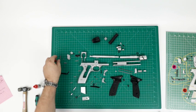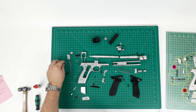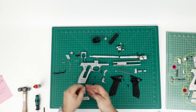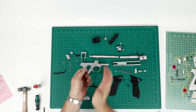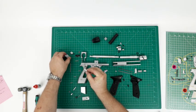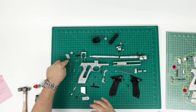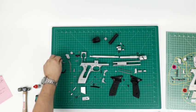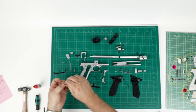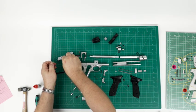Hammer, back strut. Make sure this is turned the right direction — this is real important. You've got the hammer and the little hooks right here, and they're going to correspond with the sear, which has a curve this way. That's what locks in when you pull it back. And then the strut, obviously, goes in this direction. It goes into this pivot point — grab this little M2 by 6 dowel and line this up.